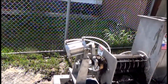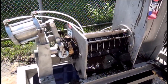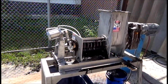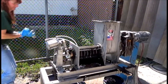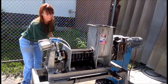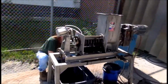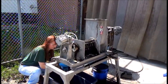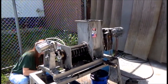The air pressure — you can see the air cylinder pushing the discharge door shut. The more air pressure we give it, the harder the screw has to push to get the cake to come out. They set it at a reasonable pressure here. On the lab press, we hate to run up to real high pressure — it exaggerates the results, which becomes difficult to repeat in a much larger, say, 24-inch diameter screw press. This screw press is a 4-inch press, 4-inch diameter screw.